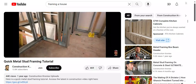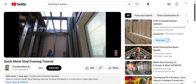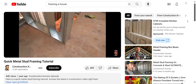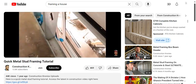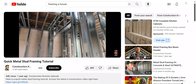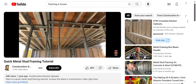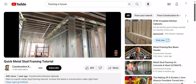I would always go 20 gauge if you're on a 25-gauge wall — go 20 gauge on your door studs, it's perfectly fine. Always leave room for drywall to pass through; you don't want to be blocked by that bottom track. The floaters are a big part of securing your walls. There's another example of different ceiling elevations — you just keep it running straight, lay out everything on the ground and follow on top. Just track and track and track. Here's another example of the floater.